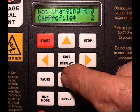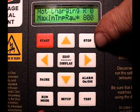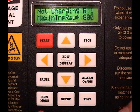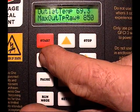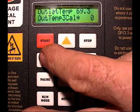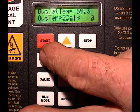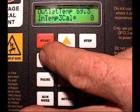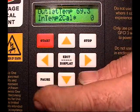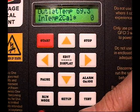Had we tried to enter this, we would not have been able to get in unless we had entered the right password previously. Now we see a new variable we didn't see before, and a couple of them back, we start seeing the temperature calibrations. You can see that temp cal 3 is zero, temp cal 2 is zero — that's the outlet. Inlet temp 3 and inlet temp 2 are both uncalibrated. This is where we're going to enter a correction value.